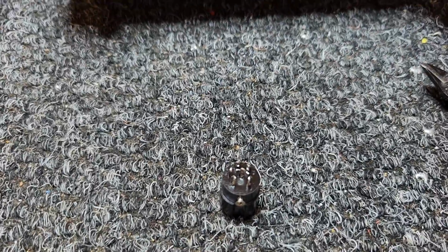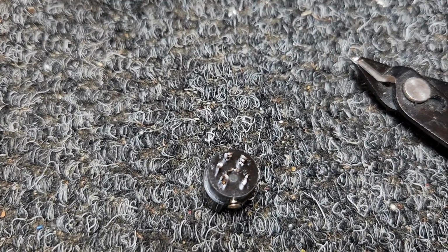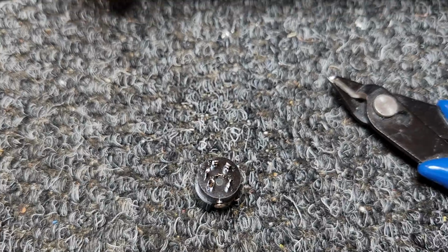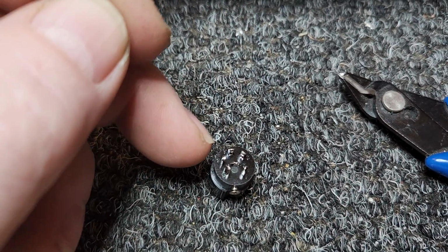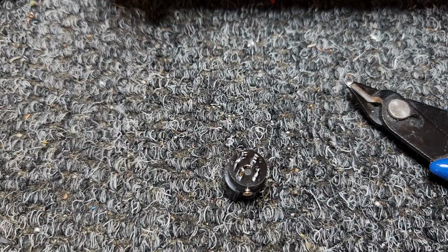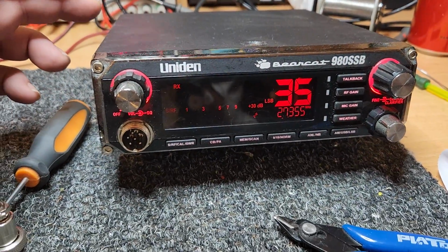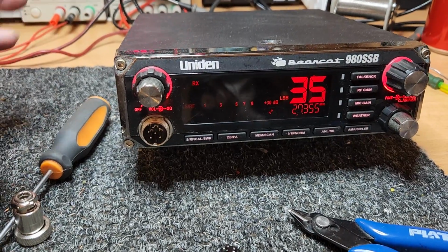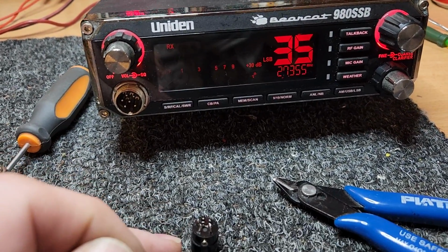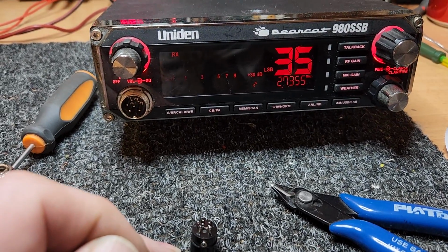So what we do is, I can't really do that, I'll show you, hang on. So basically pin 6 is no more. Now, we do it to the point where pin 6 actually could be reactivated. We could solder a blob on the end of it if we really needed to, but it just gets it out the way. If someone might get ambitious one day and think, oh, I'm going to rewire this or do something else using this plug on this radio, well, there's no way they can muck up generally the 8 volt line. And look, it's just one of those precautionary things we do.